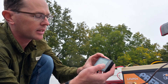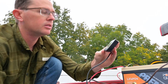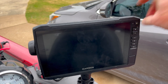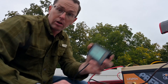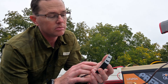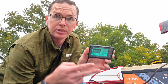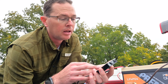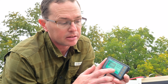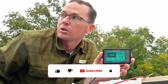Once we're done there we'll back it up and you'll see that we're at 103 amp hours. Let's go ahead and turn on our graphs and we'll see how this responds. We have it set up, we have our graphs running — we're pulling about 2.9 amps, which is really handy to see. That's two fish finders, a Live Scope, and a routing hub. This will show your current voltage, your current watt consumption, estimated duration at that discharge rate, and your percent state of charge.